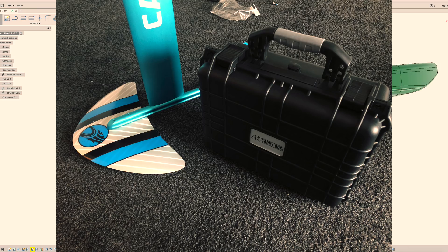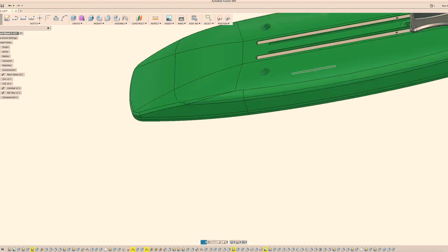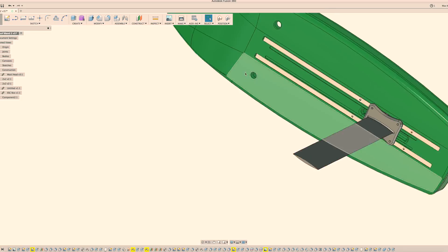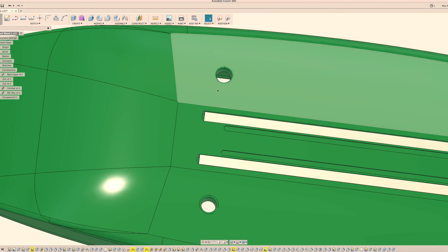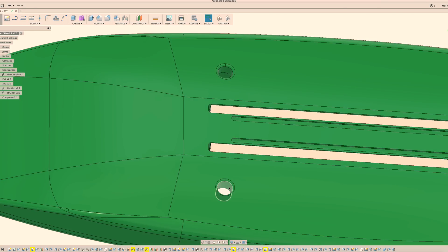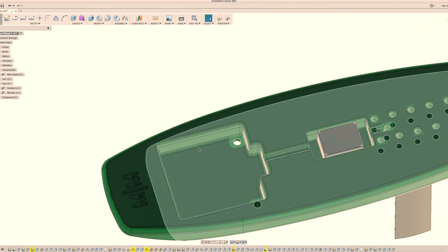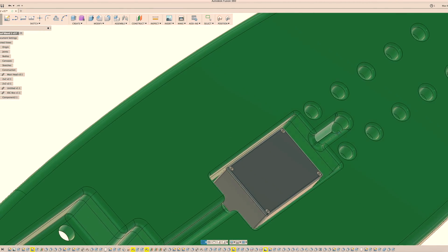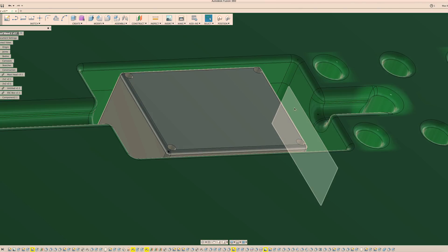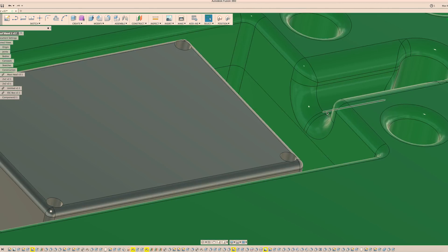Here the cables go into the ESC box, which is an aluminium housing for the motor controller. At the front there is a little bay that can house one of these waterproof camera cases for all the other electronics, batteries and so on. The plan is to cut the shape of this board on my CNC and then glass everything over with fiberglass. The two holes on the underside will be drainage holes so water that collects in the electronics bay can drain out, and the ESC box will be partially submerged for cooling with excess water draining toward the mast area.